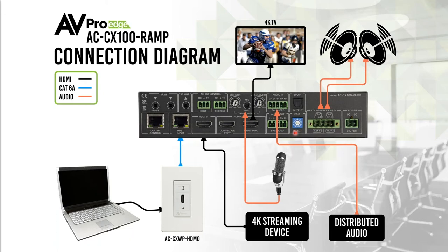For the ACCX 100 connection diagram: a laptop plugs into an HDMI wall plate, we use the HDBaseT input on the CX100, then send audio and video out to a 4K TV and audio only to a pair of speakers in the room. This makes it an all-in-one piece — it handles audio/video distribution, microphone input, and speaker amplification. This could genuinely be the only core device in a classroom, without needing external amplifiers.